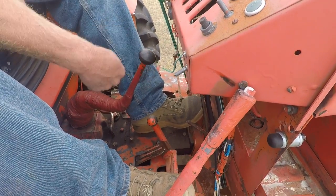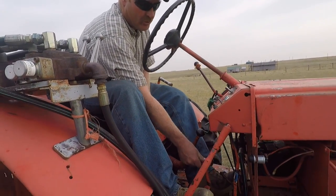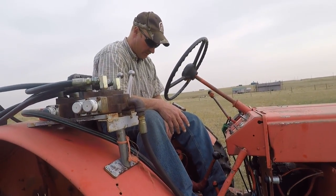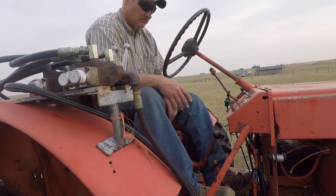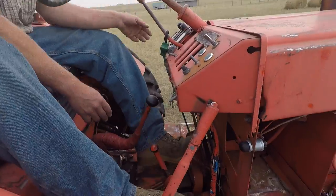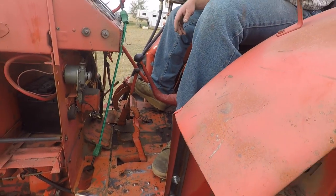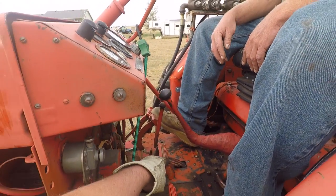This does have its own PTO — it's not tied into the transmission with the tractor. But if you push it forward, it'll engage with the clutch; if you just pull it back, it's all independent. So this has been stripped down to bare minimal to get it running. It has an independent PTO, or you can set it up where the PTO stops when you hit the clutch. That little pedal on the left is the PTO clutch, to engage or disengage it. You'd use that if the PTO was shifted by itself, or this if the PTO was shifted to work with the transmission.